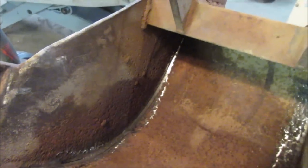I got in there first with a wire wheel, and then I came back with a grinder. Did the best we could. See all those little rust pockets, though? That's the stuff that pushes the contaminants out of your weld, and all of a sudden you hear that little popping sound. That's the crap coming out of there. I wish I had a roll of flux core, I'd switch over to that, but we're gonna do the best we can. Anything's better than what it was, right?